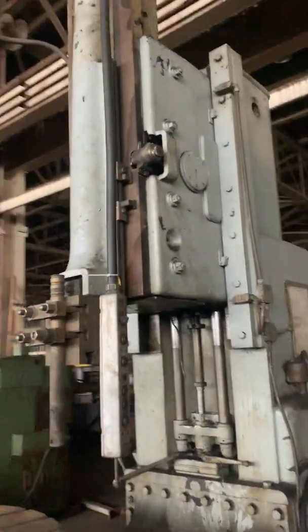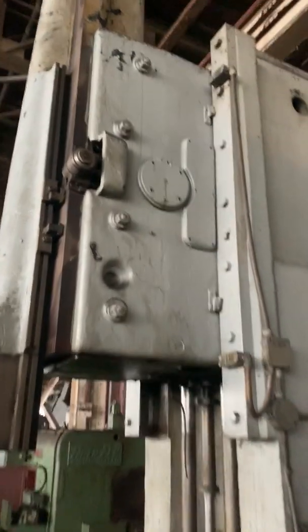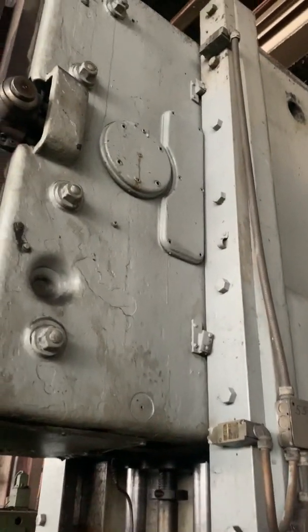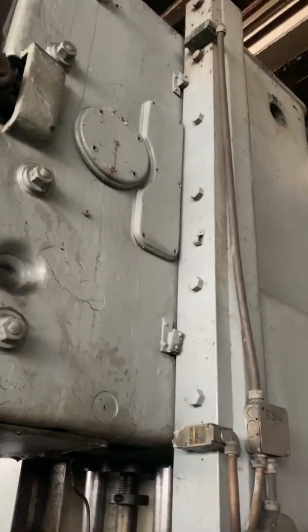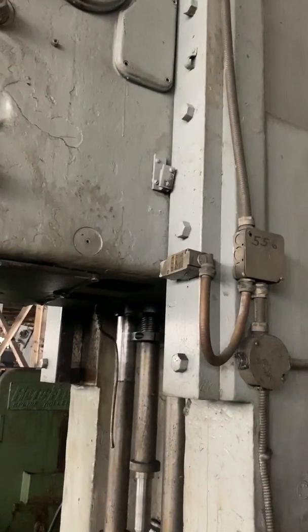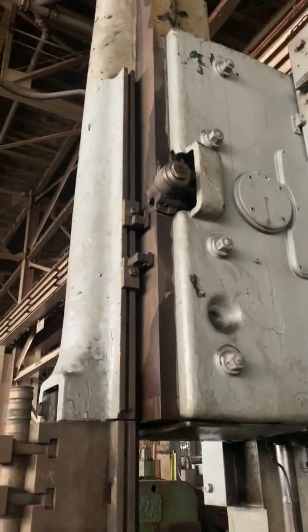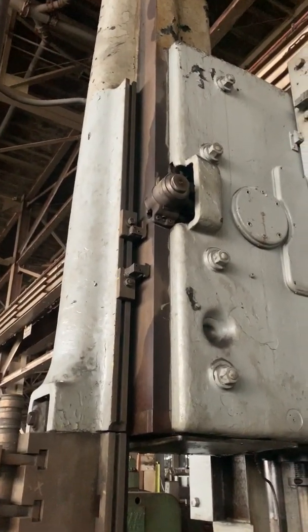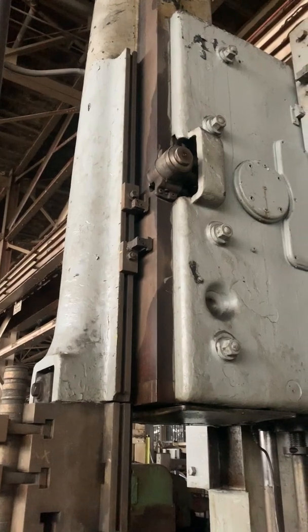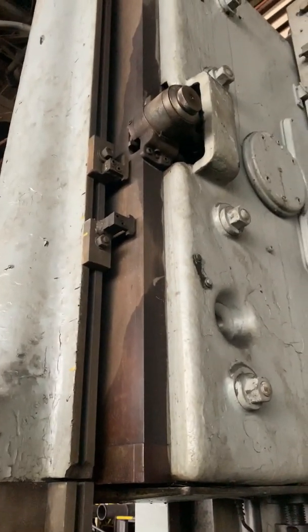Here's the vertical head in the RAM. You have 16 inches of adjustment on the RAM. You can see that here between the limit stops, the limit switches, and where they have the stops positioned — top or bottom. This is your adjustment for stroke, 6 inches to 36 inches. Really easy, just by moving those dogs.